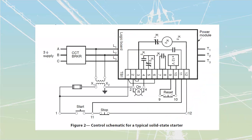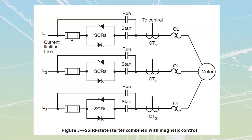In some cases, soft starters will transition the soft start section itself offline once up to full power. They'll go to a contactor that fires in at full speed, bypassing around the SCRs that are controlling the main current. During startup, only the SCR path would be energized — current passes through each line through the SCR to the motor. Once the motor gets to running speed, we transition to the run contactor, and then we can open the startup path.